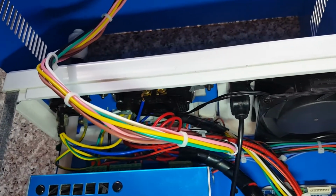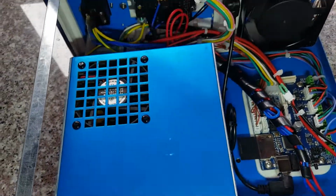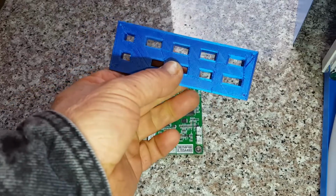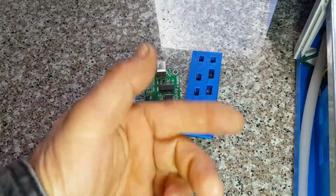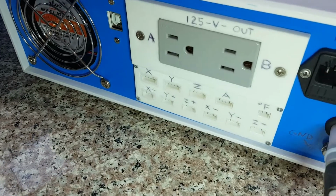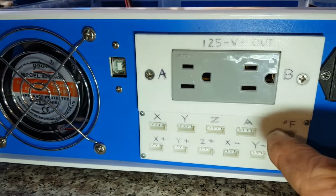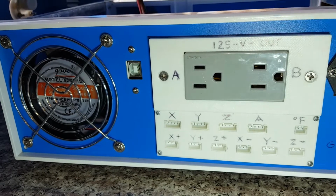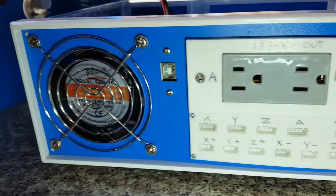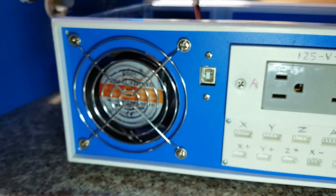The wiring is, like I said, set up stock because I'm using the stock power supply. I use a lot of the stock equipment. I had this thing running with the stock Nano. I was going to use the same system I have here for hooking up the laser, right here, except this is for a Nano board, and this is for a Cohesion 3D board. Here's the outlet cover I had to make, because the one that comes with the outlet just doesn't work. It's too wide. But the 24 volt stock Cohesion power cord will plug in right here.